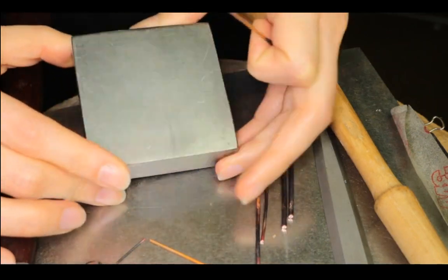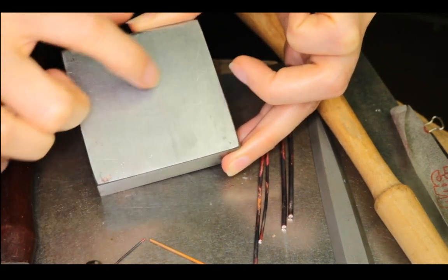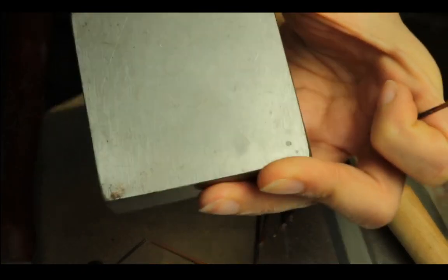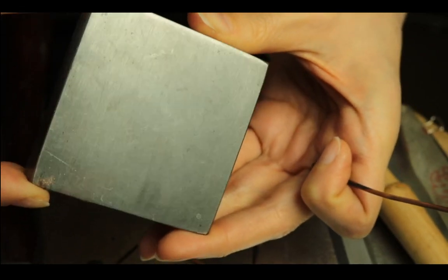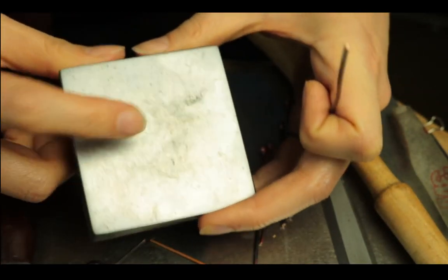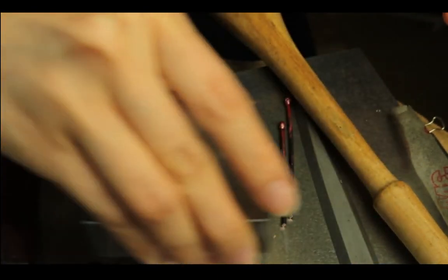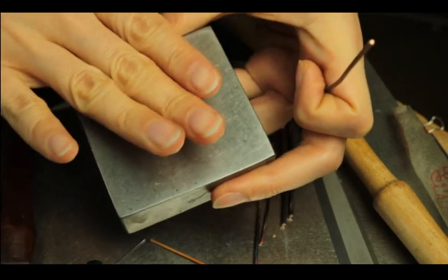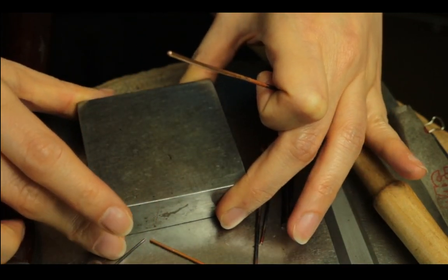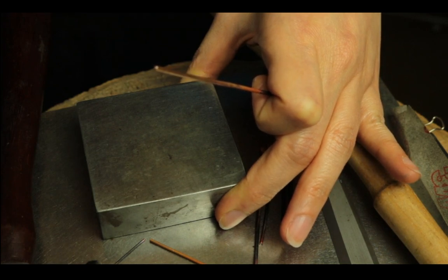The only downside of this steel block, because it's so cheap at Hobby Lobby, especially if you have the 40% off coupon, is that the surface has a little bit of texture. I'm not sure if you can see it on the camera here, but it has kind of a brush texture. So what I did was I sanded the surface, putting sandpaper on a surface and doing a circling or figure of eight motion, so I make sure that it is sanded flat. I think I started from 120 and then went finer and finer. What is after 120?